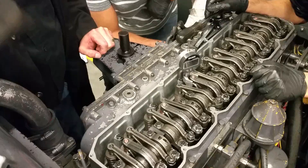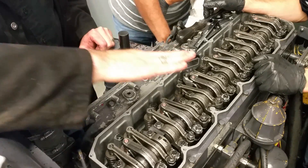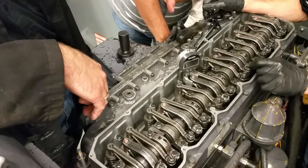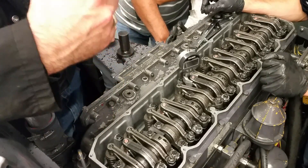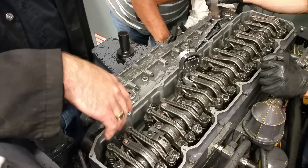What are we reading out there? Minus 1.79. We were zeroed, and when the plunger moves out on the dial indicator it goes negative. But we need to do 62 millimeters plus 1.88 millimeters to get to our 63.88, so we're not quite there yet.